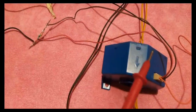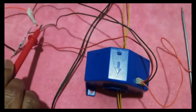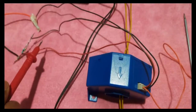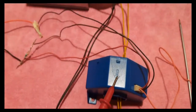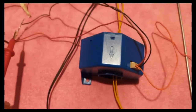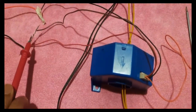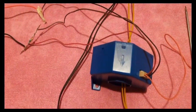The 24-ohm resistor's other end is connected to ground. The output of the sensor is a current signal, and to interface with my microcontroller, which operates at 3.3 volts, I need to make sure that when 300 amps of current passes through the sensor, the voltage does not exceed 3 volts. So I made four 100-ohm resistors in parallel, giving an equivalent resistance of 24 ohms.